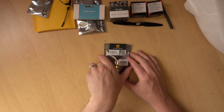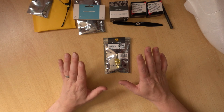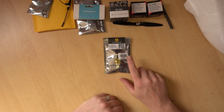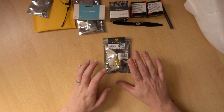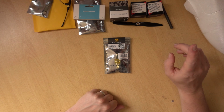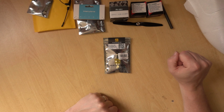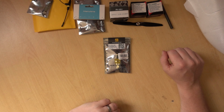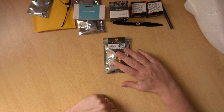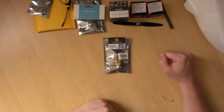This flight controller here, the F405 WSE, is what I actually bought to do this build. The reason I bought this is because out of all the flight controllers I would go for, this is the cheapest. There are F411s, but personally I would avoid them. With this model, there's plenty of room. The only reason I'd go for an F411 is space limitation. Everything else they just fall far behind on: the power side, the number of UARTs. The F405 size and up are just better flight controllers and give you more options.